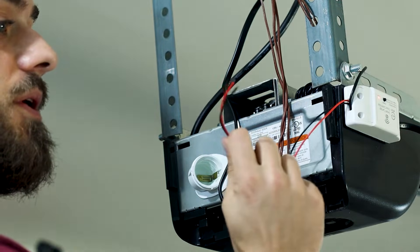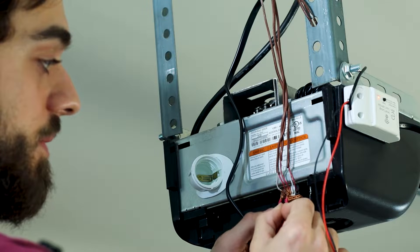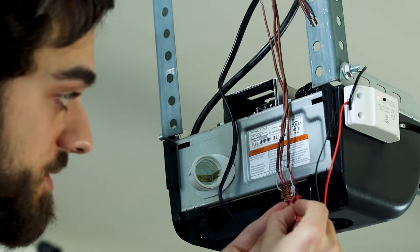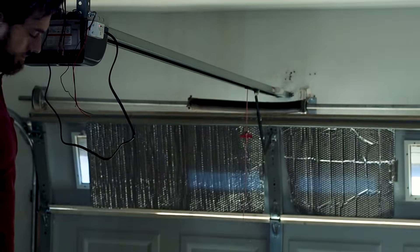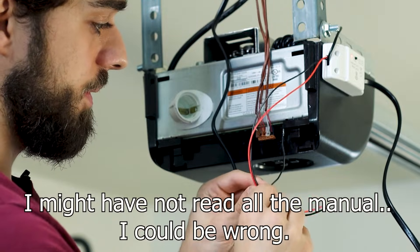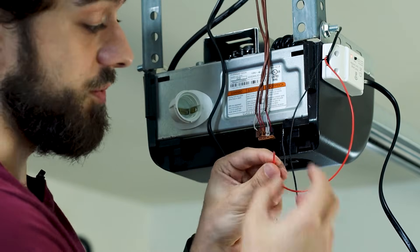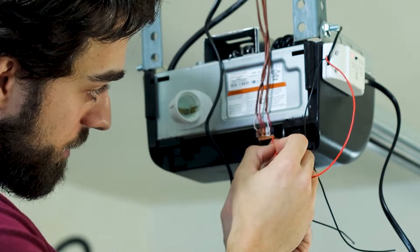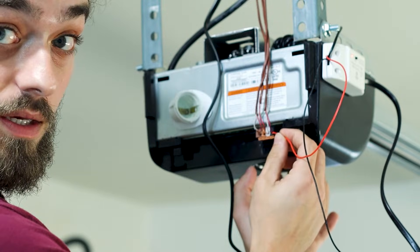The next step is to figure out where these wires are going to go. To do that, you need some sort of jump wire. What I did — I went from each one and tried to connect it until finally the garage door opened. The two wires that open up my garage door are these two end ones right here. There's no specified way to do this, but I'm assuming I'm going to put red with red and black with white. You might have screws on yours, so maybe undo the Phillips head, strip this wire a bit more if you need to, then wrap it around that Phillips head. For me, I just place it into this little hole right here, push all the way back, push the wire in, and it should be snug. Then connect this one in — should be snug.